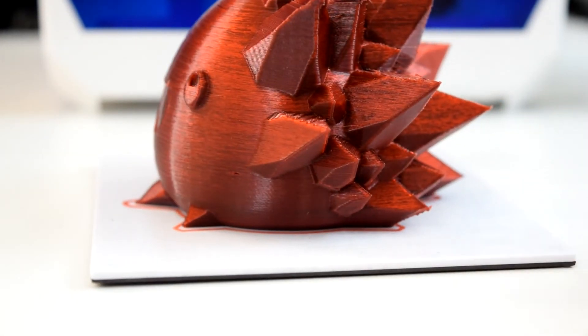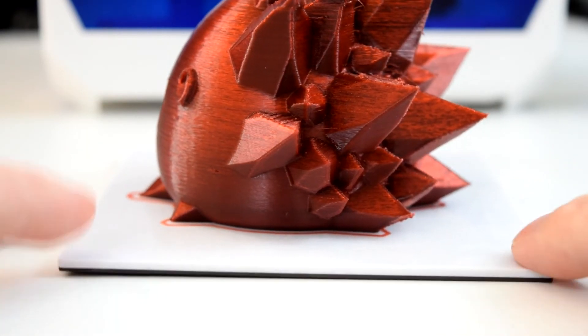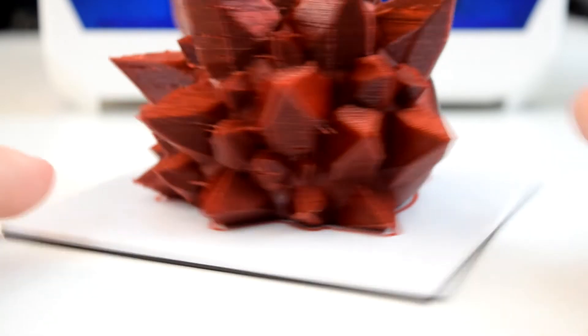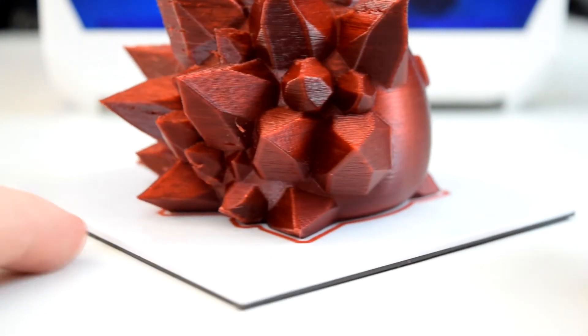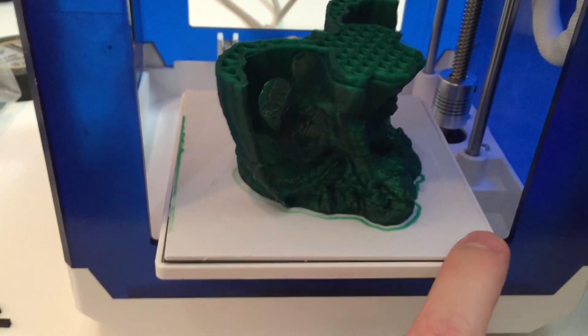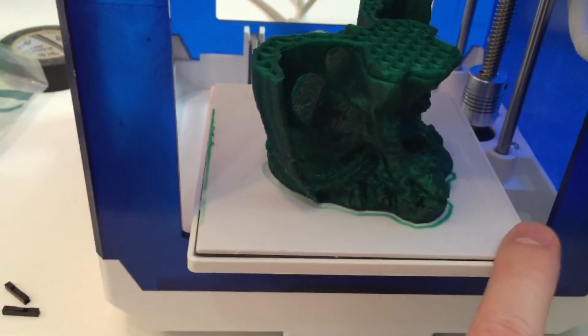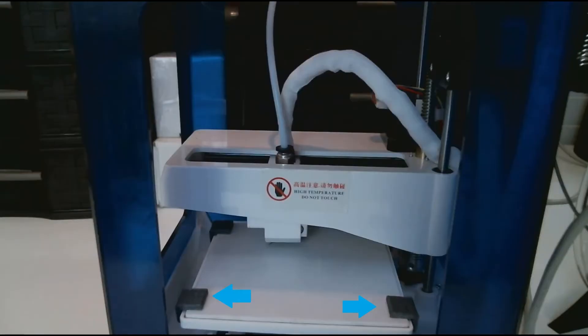Assuming your first layer is making solid contact, that means the print is going to be putting excess upward pressure on it. Since the bed is easily flexible, the sides and corners have a tendency to bow. This may not seem like too much of a problem until you realize the warped-up corners mean the print bed will wiggle around, causing layer shifts and in some cases skipped layers altogether. However, either some printed bed clips or alligator clips on all four corners of the bed will pretty much make that a non-issue.